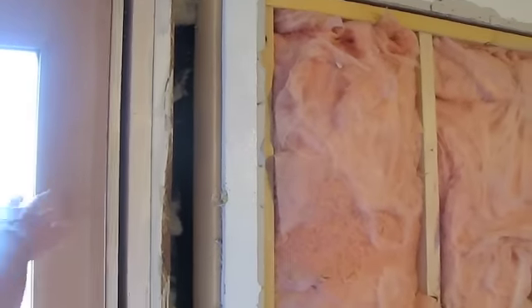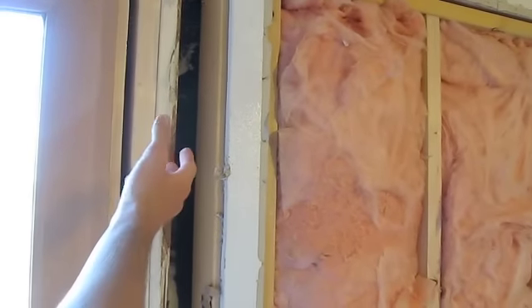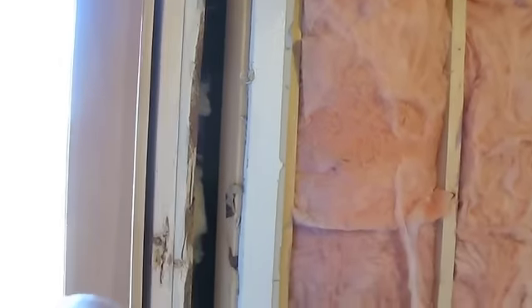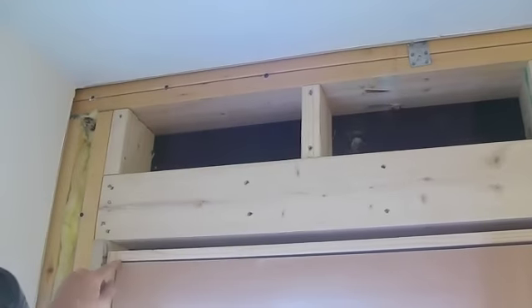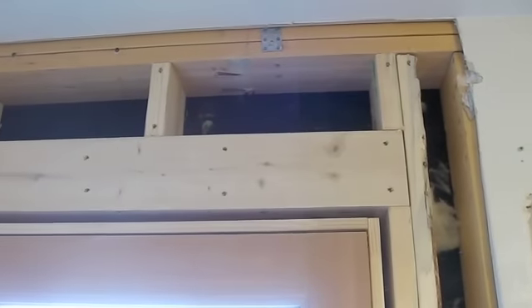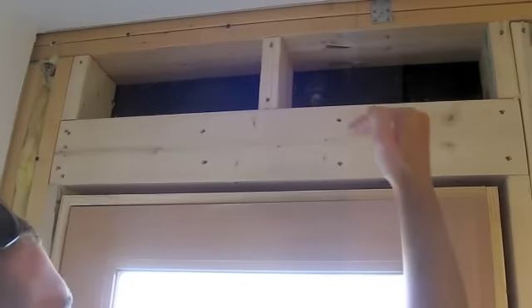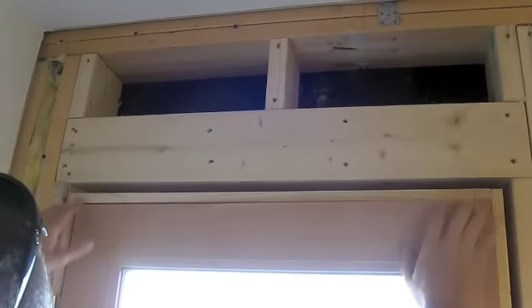Since I have the screws in now, I can make sure the door won't fall out so I can actually close the door. This is something else you have to check, but you can't check this until you have the screws in, otherwise the door will fall out. They call this a margin — that's the space around the door. You want it to all be even. You can see it's greater here than here, and to solve that I will tighten this screw over here and loosen this screw here. Shifting the top of the door, the whole frame is going to cause the door to lift up over here, and then it will make the margins equal.